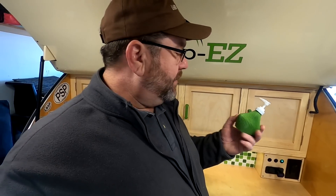When 3D printers first came out, they were like $1,000, and there was no way I was going to spend that kind of money to print parts out of plastic. But now they've come down to around $100 to $150 — a lot more affordable. One of the cool things is that when you download the free designs off the internet, you can resize them and make them any size you want. I went on Thingiverse, downloaded the file for the handle, and when I printed it, it was a little too big, so I went into the program that comes with the printer and scaled it down to like 77%, and it came out perfect. And since everything you print out of that roll of filament is going to be the same color, I was able to print out this cool soap dispenser to match.